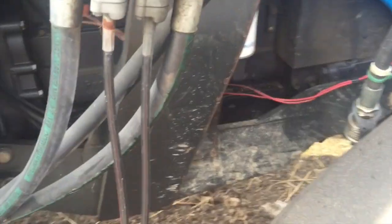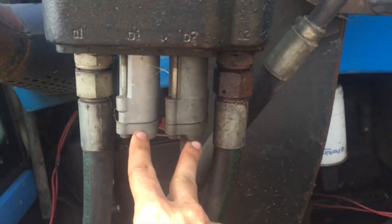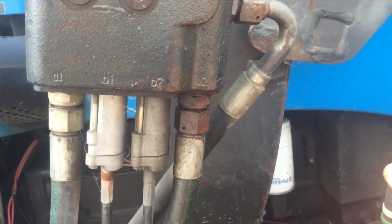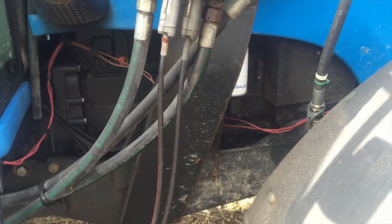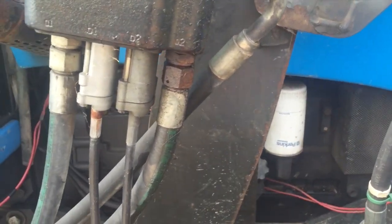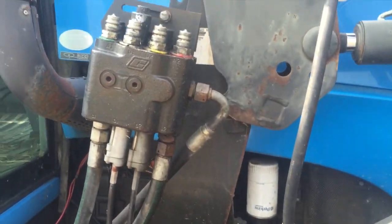Just a quick note: these two electronic lines are what run to your joystick and allow you to go forward, up and down, and tilt the bucket. They line up with each one of these hydraulic lines. If you had a fully hydraulic system it wouldn't have electric lines — it would have hydraulic lines going inside there. But this one has electric assist, so that's what we're working on. I'll line it up and bring you back after I put the hoses on.